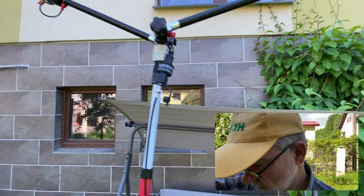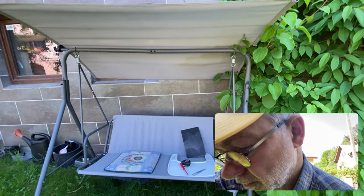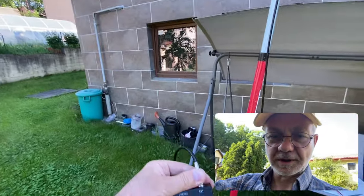Now I just try to quickly tune onto 40 meters — 7 megahertz. And what do we have? Look, we have a very nice SWR: 7.1 megahertz and SWR is 1.4. So most probably, with a bit more fine tuning, I could make it one-to-one. Now I think I can tune and re-tune the coils easily with one hand, and at the same time observe the changing SWR on the antenna analyzer.